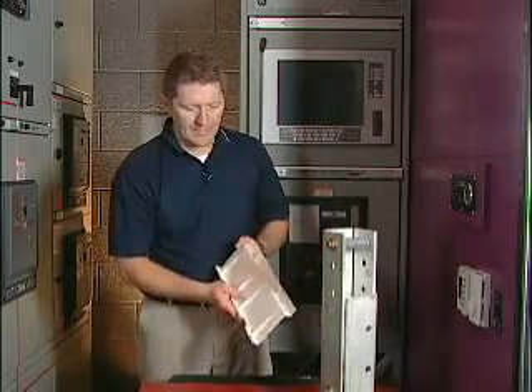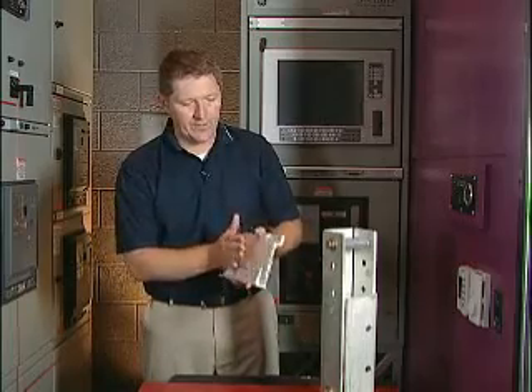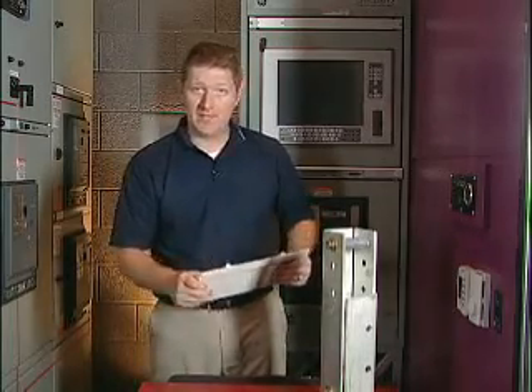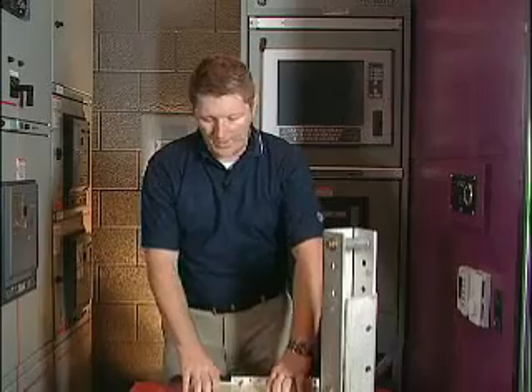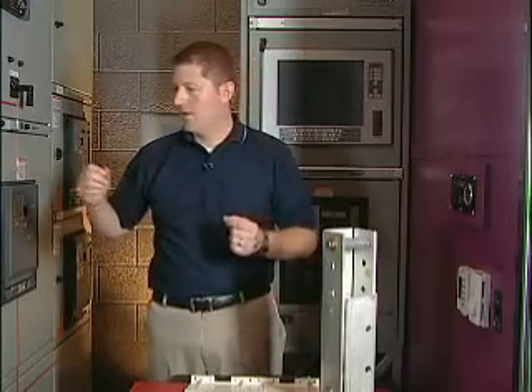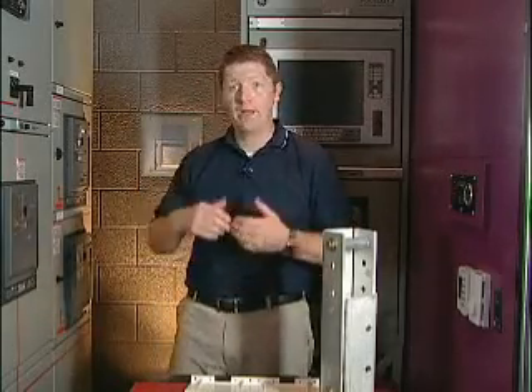I also want to show you our insulated and isolated bus system. We have extruded composite material — glass-reinforced fiber — for insulating and isolating the bus, again for arc flash safety and maintenance. We also use a lot of standard glass polyester reinforced sheet for insulation. In the rear cable compartment, it's very spacious, allowing multiple cables to be pulled in from the bottom, from top-out assemblies, or from the side — very generous space for multiple combinations of cable pulls. We also have NEMA 3R and outdoor enclosures for those that need outdoor space. For arc flash safety, we have mechanical shutters in our cassette assembly up front, and CTs are front-accessible as well, so you don't have to go into the rear for your relay and metering CTs in most cases.